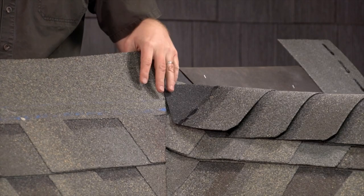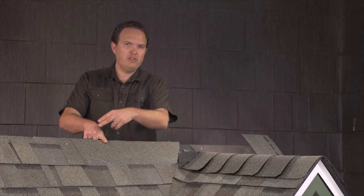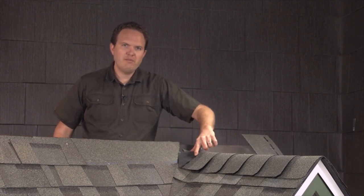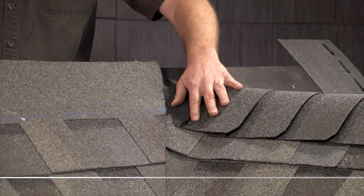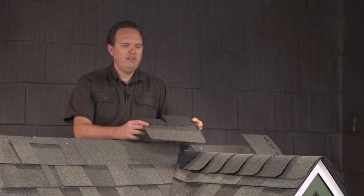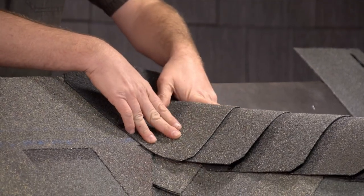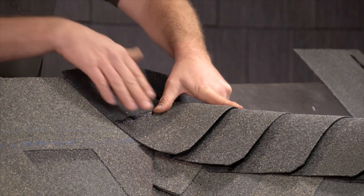The shingles coming over here — realistically this shingle has its cut in the valley and you're going to want to bring it over onto this other side where it'll get a notch, like we're going to show you with the shingle that comes over the top. I want you to notice that on this last ridge cap I've had to trim it a fair amount, and I've got the nail up here. Normally you'd want your nails further down, but we're in the valley, so we always want to stay six inches out of the middle of the valley. Then I've got another ridge cap shingle and I've cut a slit in it up to the glue line — that's going to allow it to come in here and bend in several different directions, because it's never going to bend properly without the slit.